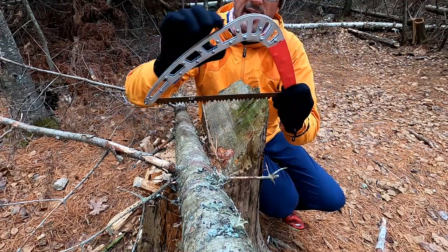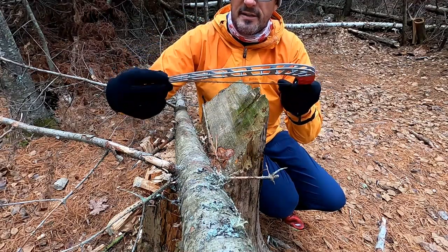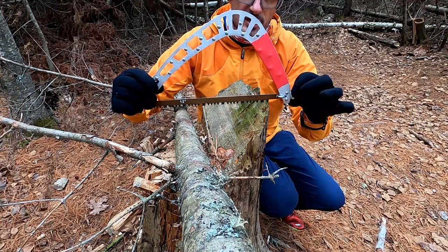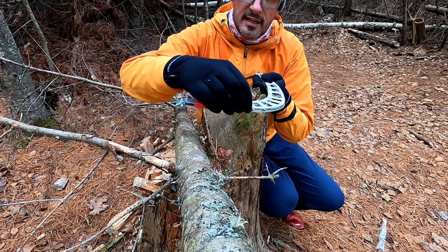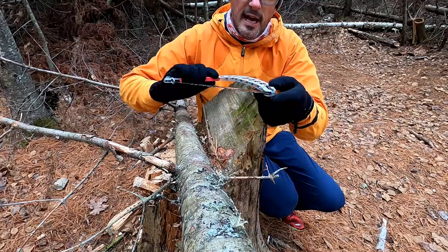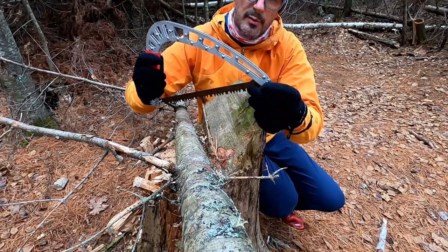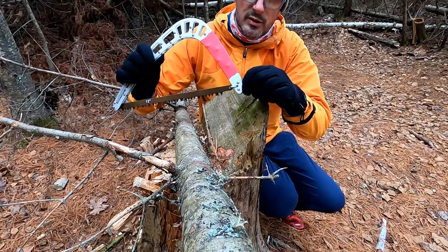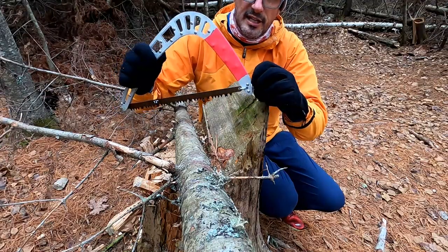The two engineered boomerang-like pieces have aluminum offsets in between to create rigidity. What this does is allow you to tension the blade a lot. There is some heat shrink around the handle for comfort, and a removable dowel pin at the front with two spacers through the blade so that you can replace it. At the back is a washer with a wing nut that allows you to tension it.